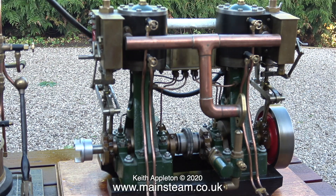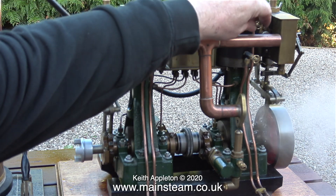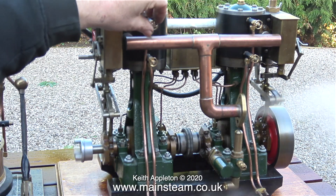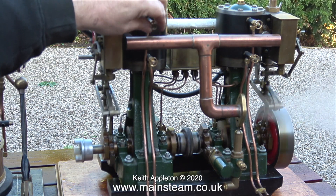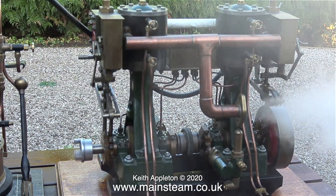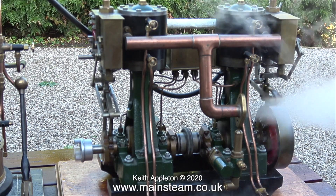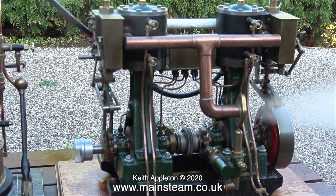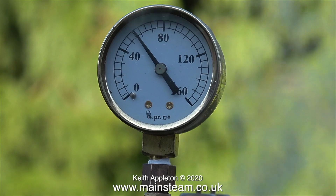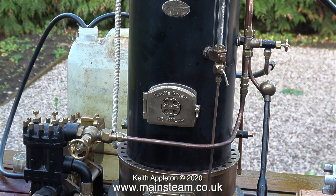The first hot steam that reaches the cold cylinders of the engine immediately condenses to water. On the subject of clearing condensate, I'm also running the engine with the drain cocks open so all of the condensate has been drained from the cylinders — unfortunately the bottom of the pipes where the water's coming out is just off camera. The larger the engine, the more important it is to open the drain cocks before you run it. It's the same principle as with a steam locomotive — if you watch films or videos about steam locomotives you will notice that when they first set off, lots of steam comes down to the front of the cylinders. The last thing you want is a hydraulic lock with water in the cylinders.